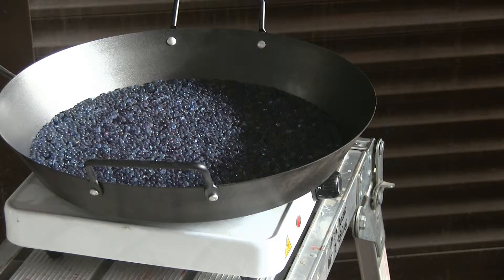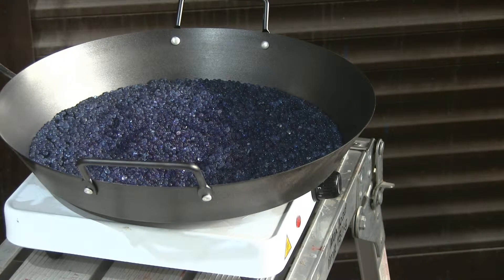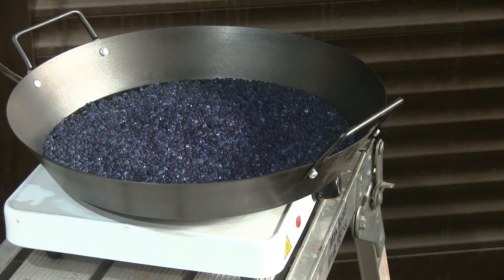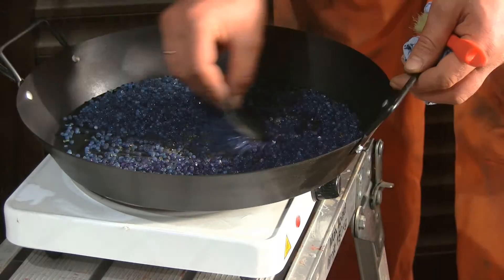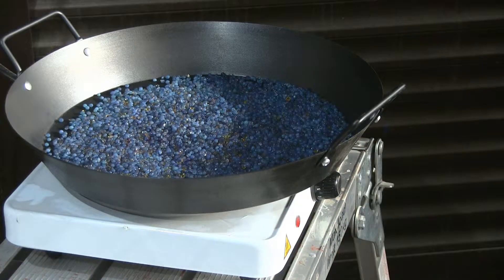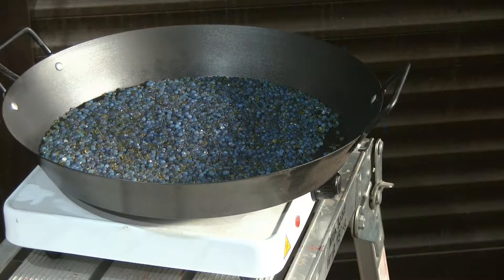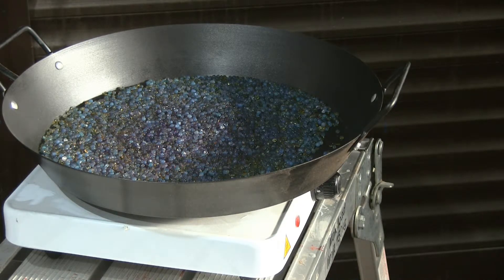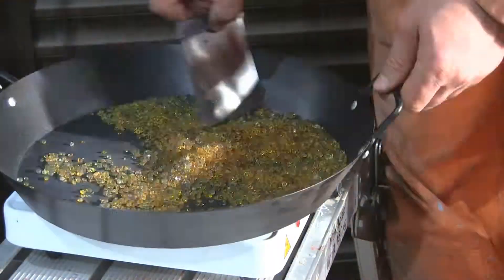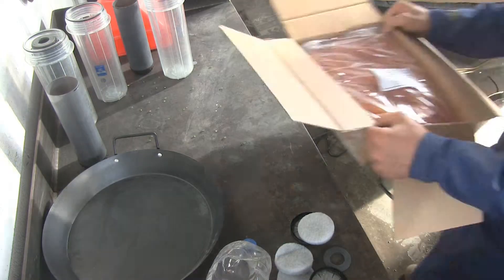So I had to load up another batch onto an electric oven. If you pay attention you will see the granules actually change color and become a bit more yellowish. This way the moisture can escape and the heat input is very well controlled and kept to a minimum, and you can bring them back to life. Unfortunately by the time I discovered all these issues I had already destroyed most of my silica gel, so I couldn't use it for the inline air filter to remove moisture from compressed air.